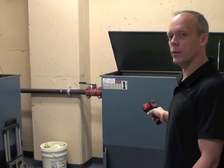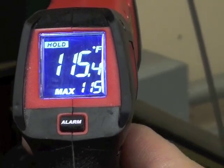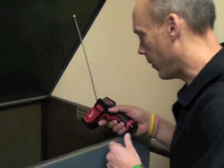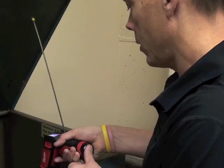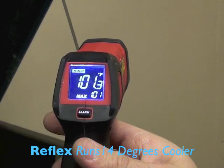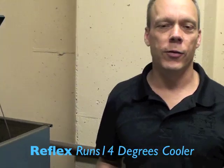We're going to take a look at the temperatures of the two elevators now and see what the difference is, to get an accurate reading. 115 degrees on elevator number one. I have seen these elevators during the day when it's busy get up to 125 degrees. Elevator number two: 101. So we dropped the temperature 14 degrees with the new leveling system.